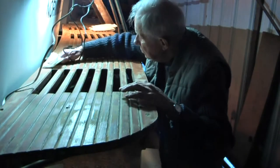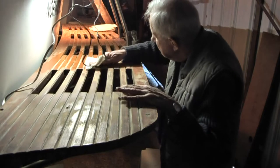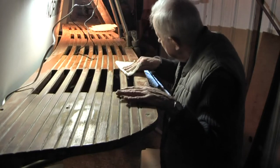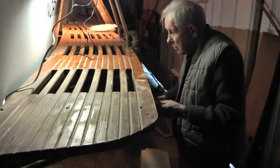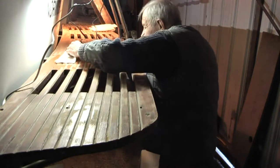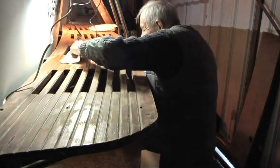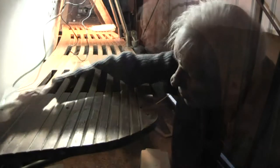Once finished, we had to clean. We like denatured alcohol, and we used that to clean up whatever was left in terms of sanding dust — but we had used our shop vac on it first. So there was amazingly little crud before we were able to apply the Sikkens. We had to go down each one of those little grooves and clean out whatever was in there. It worked fine.